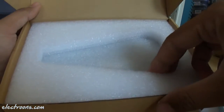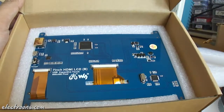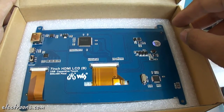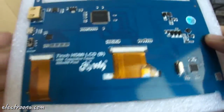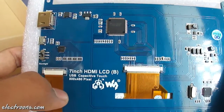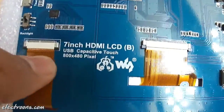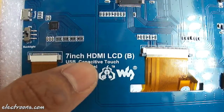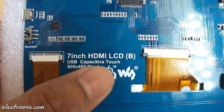That's it for accessories. And apart from this we have the actual LCD panel. At first look this looks like a very nice high-quality build. The PCB is really good quality and the surface finish looks very good. It says here '7 inch HDMI LCD' — it's a B type. They have some 2-3 versions of HDMI LCD. The resolution is 800 by 480 pixels, and the capacitive touch is interfaced using the USB connection, so the display is driven by HDMI while the capacitive touch is driven by USB.